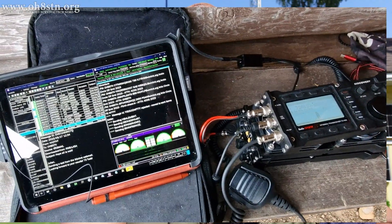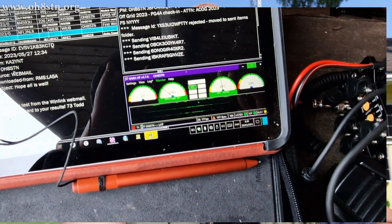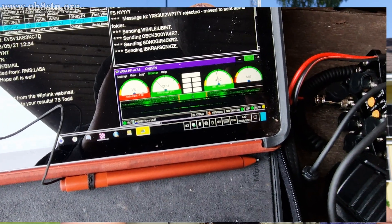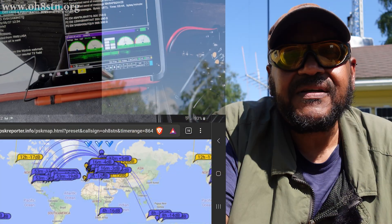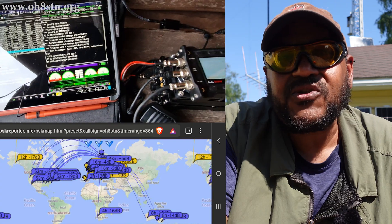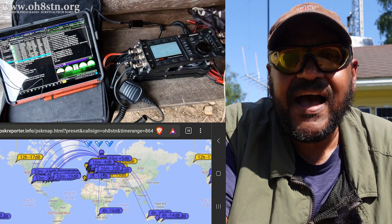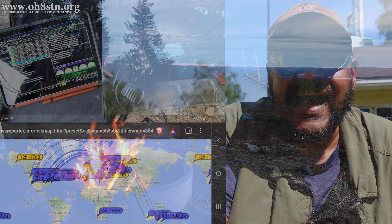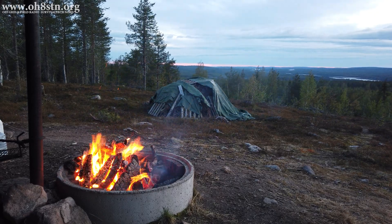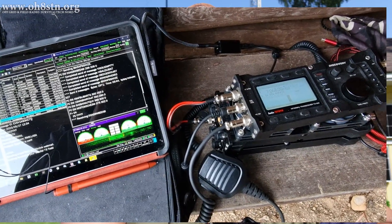For the amplifier — normally a QRP radio is quite enough for me, 10 watts or even 20 watts if I'm using the G90, which is more than enough for most things. However, because I wanted to reach over the North Pole and get into North America or down into Australia at certain times of the day, working the gray line, it was important to have enough power to make that happen. The higher in latitude we are, the more difficult it is to get that signal out around the world, so the amplifier was a critical backup system for that.